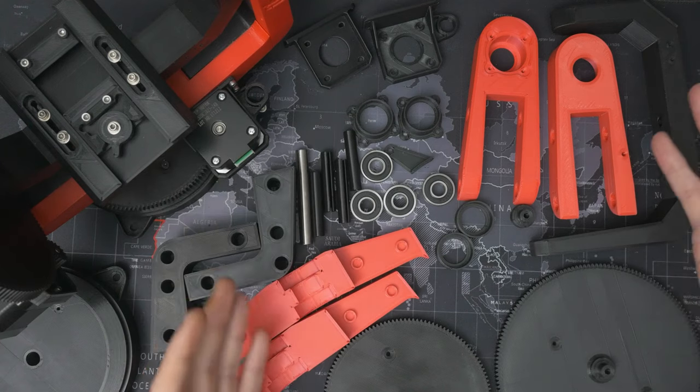There is one thing that I wanted to add here - I've got one on this version already. I printed a little red washer. This is to basically prevent the gimbal from riding straight on the flat surface, because when they're tight together these two surfaces rub against each other. So this little washer basically sits above or below a bearing to keep this raised up off the base, so that when your two arms are spinning around they're not rubbing against it.